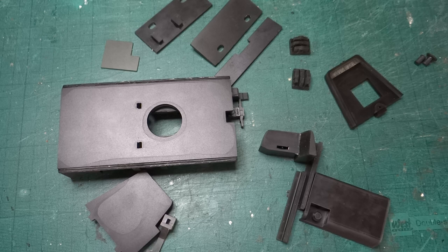So as I said, there will be instructions. As I say, they're more notes along the lines of what we've just talked about, but hopefully it should be fairly easy for anybody who's built any kits before to put this together. As I said, the hardest part is fitting the metal cowl and making sure it's exactly the right size for it to fit nicely against the loco. But it's just a question of taking it easy, not rushing, and taking some very small amounts off with a file until you get it just right.